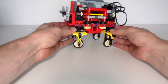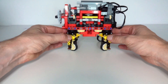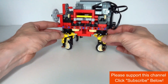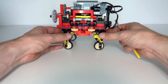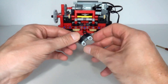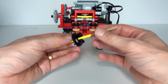So the idea is that we want to drive forwards and backwards, and then rotate on the spot by rotating the wheels themselves - pretty much like a supermarket trolley - at 45 degrees, which would make the vehicle drive in a circle on the spot. The first challenge was to design the wheel element so that you could both drive it as well as rotate it. LEGO provides a very convenient turntable element that allows you to rotate one element while passing an axle through the middle to drive a secondary function.